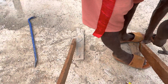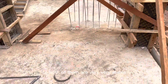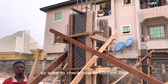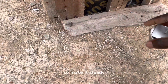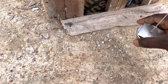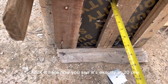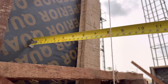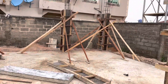We have our distance nailed at 21 cm. We nailed out the two bracings — we have a cross bracing here linking this column to that one, so both are very stable. We've plumbed it, and now we want to confirm that the measurement at the bottom is the same as at the top. We'll make the plumb bob steady. Check it here — it's exactly at 21 cm. Check up here — it's at 21 as well. That means our column has been properly plumbed.